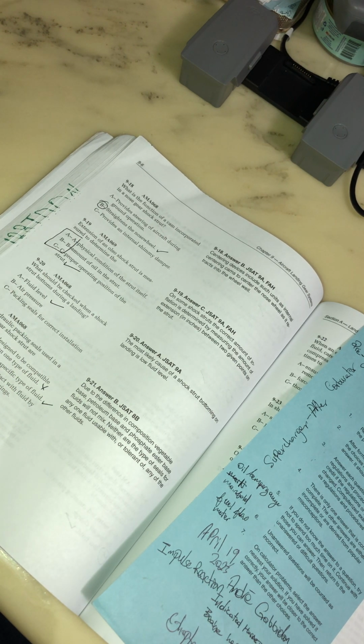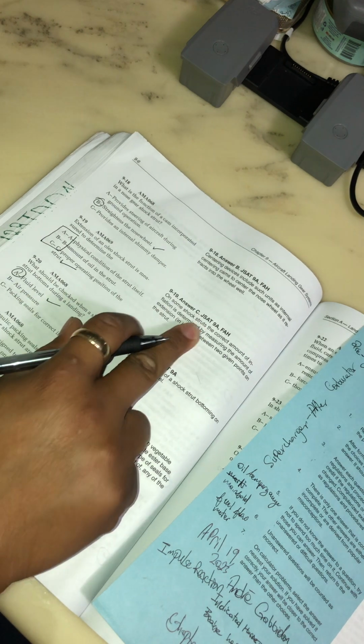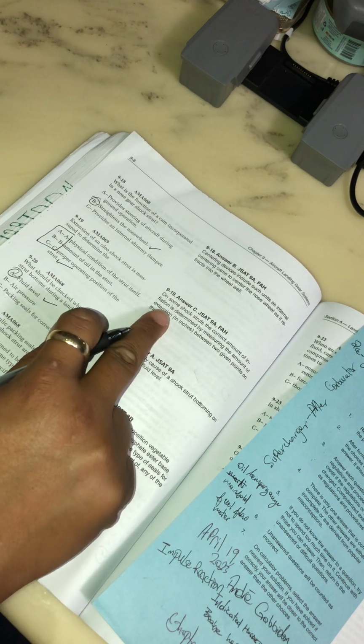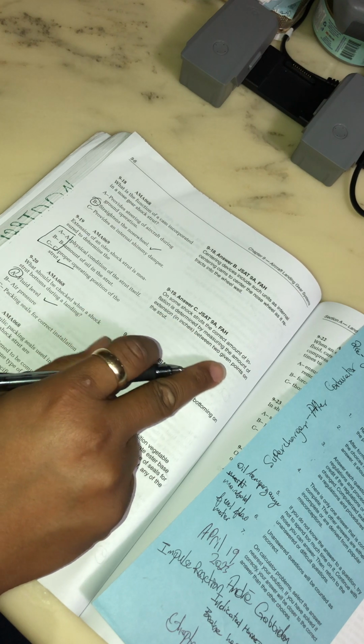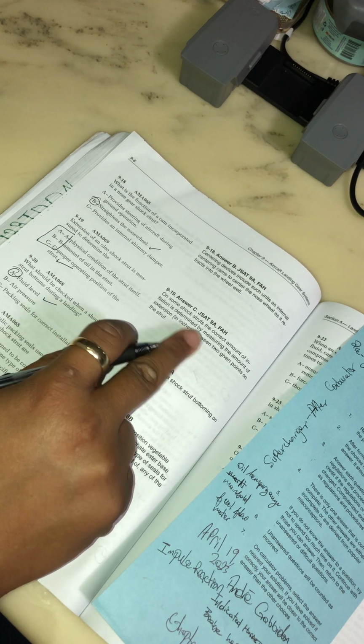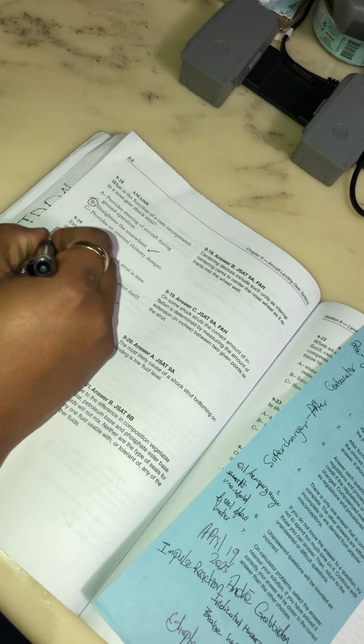The most likely cause of shock strut bottoming on landing is fluid level. Extension of the oleo shock strut is measured because on some shock struts the correct amount of inflation is determined by measuring the amount of extension in inches between two given points of the strut. C.